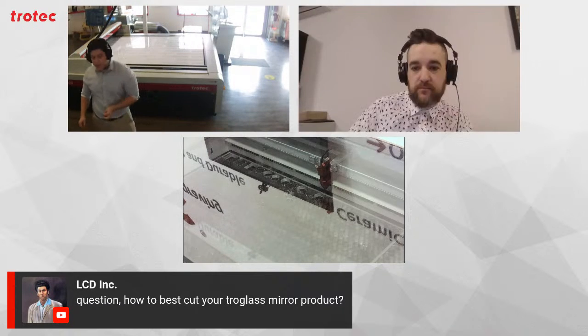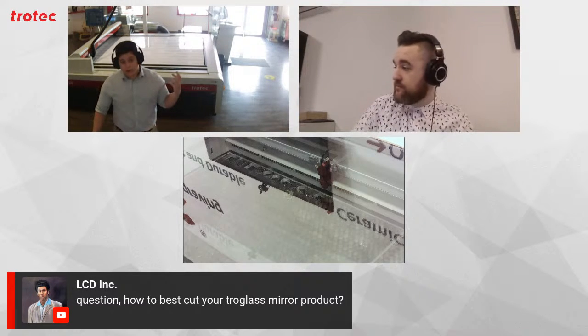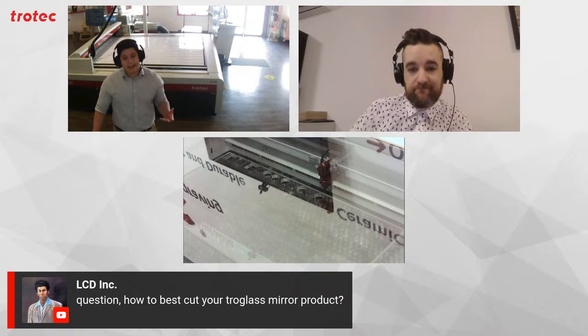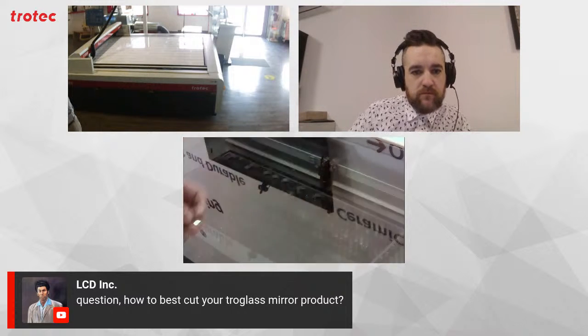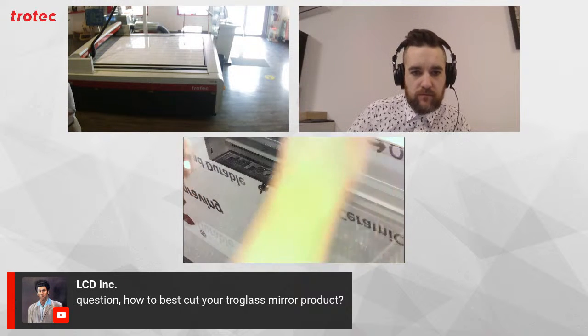Okay. So if you're having striation problems, the last Cram Session answered a lot of those. Basically you go slower, a little bit out of focus, or you don't use air assist. If you want, use a higher lens, so 2.5 or 4 inch sometimes. There's a few ways to fix that besides just going slower. I actually have one of the samples that I was doing here that I went very slow, and I don't know if it will show, but it was crystal clear. There was zero striations.